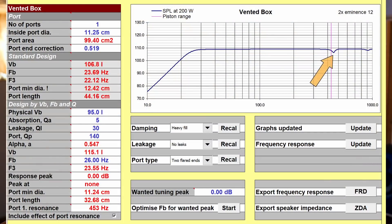I talked about making the port shorter, and the primary reason for that is resonance you'll get in a longer port. You can see there's one here at around 450 hertz — it's not really that bad. When you put a lot of fill in the box, it does a couple of things: it damps that port resonance to a certain extent, making it less audible, so I don't think that'll be audible at all. It also makes the box seem bigger than it actually is — all that fill adds what you could say is equivalent to airspace. You start with a smaller box, put a lot of fill in, and it acts like a bigger box.